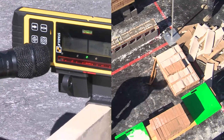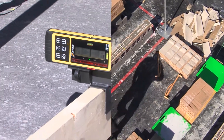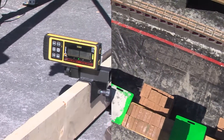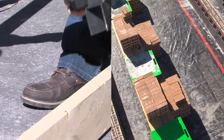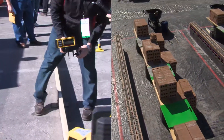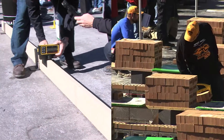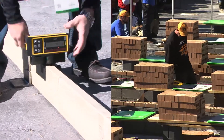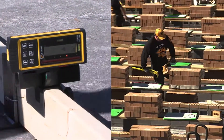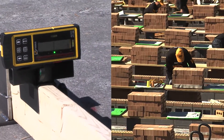Once that target shuts off, it stops being a transmitter and turns into a receiver. Once that's done, I'll remove this bracket. Anybody who does concrete will understand this format. When you're doing footings, what we're doing now is getting a true 90 degrees with no tape measures. It's telling me which way to go, so what you'd do now is start to align your footing boards.